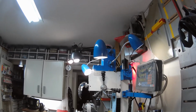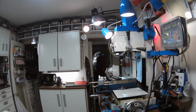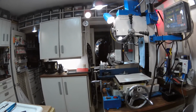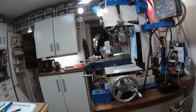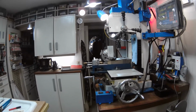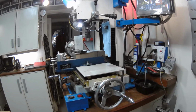I get tired of cranking it, so I put a motor on it with a power supply and a little box. The other big thing that I found helpful is I replaced the small aluminum crank handle. This is a 6-inch cast iron wheel. It's available on eBay. It is listed as a Bridgeport milling handle, and I can get these rotating metal handles on eBay as well.